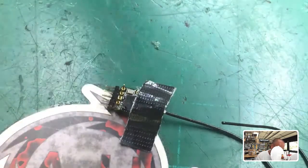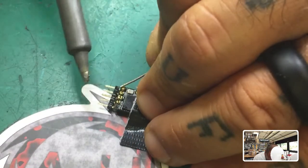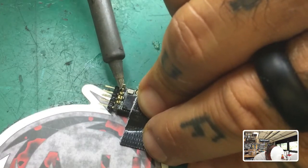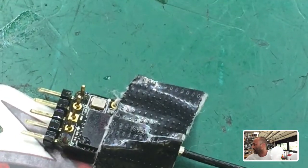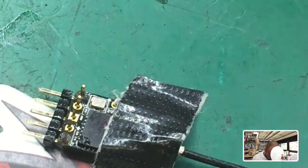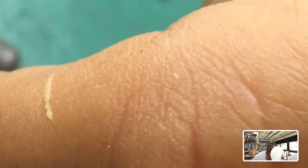Now my main thing is to get one pin holding so I can finish the job. I know a lot of you won't put pins on your receivers, but if you find yourself needing to, this is how I would do it. I'm gonna take the pin closest to me and just quickly hit it right there — what will happen is it'll automatically spread and now it's in place. The solder will find its way down and seal between the pin and the hole. Just a couple touches and it'll spread on its own, giving you a very solid connection.